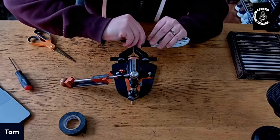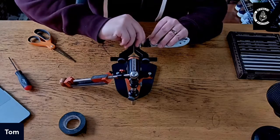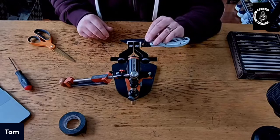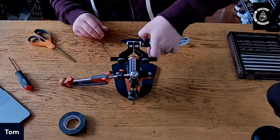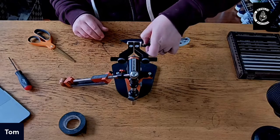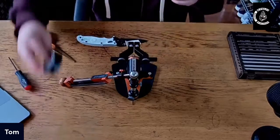So this will be pushed up against the flat grind line. I'm using my fingernail to kind of tuck it in that little groove. And once I got that in there, that part of the DLC will be protected, so I can take the stone and get really tight up against it and make a nice square heel. So do it both sides.